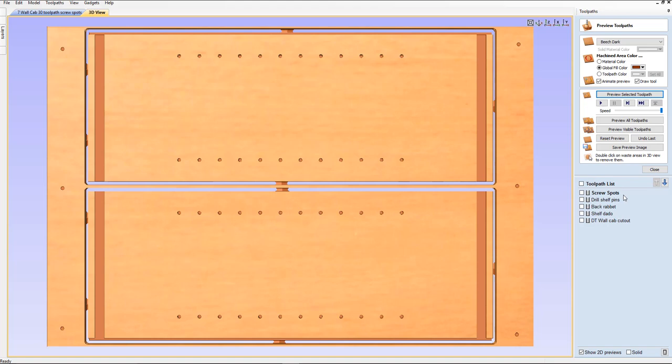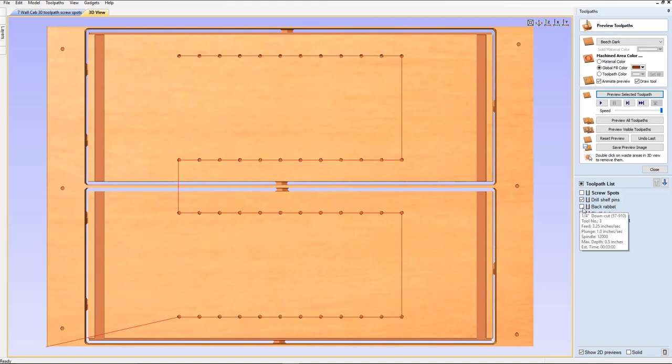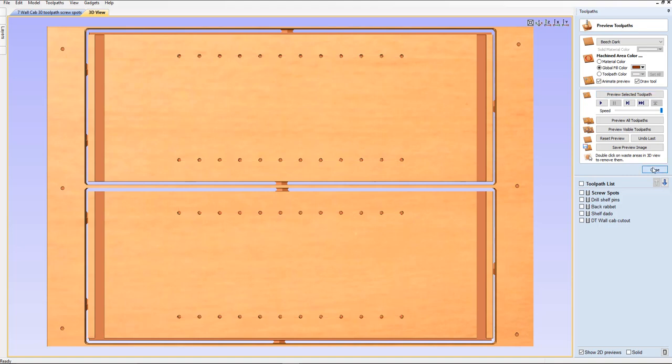Your material is placed right here at the X, Y, and Z in the corner. Make sure that's tight against there when you're doing this. Just let it go — you should be able to, without holding the plywood, make those little spots there real quickly. You can always pull down one side manually if you need to while it's doing it. Make sure you keep your hands out of the way. These other ones will all group as one — and remember, cutout as the last one. Now remember that very important thing I mentioned: any bow, anything where that bit's coming over and it's lifting up after cutting and there's a little warp on that — if it catches that plywood, could be disastrous.